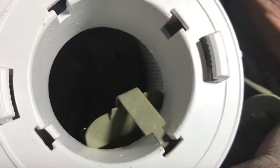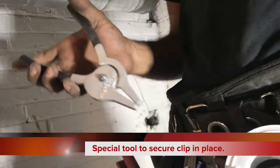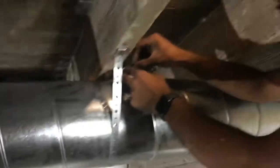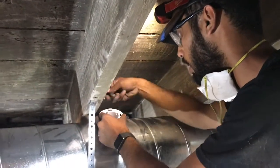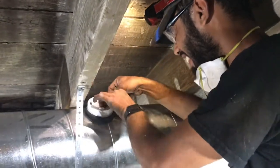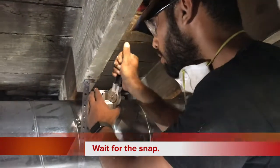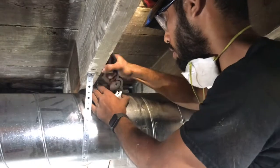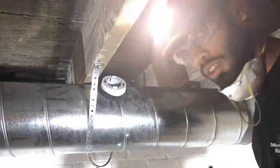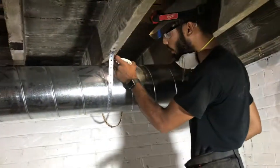There are four retaining clips that go inside. When you push them down they snap in, and space pack actually provides a tool to help with that — which comes in handy. You can do it with your fingers, but after 347 openings your fingers would fall off. You want to hear a secure snap. Then since we have this at 45 degrees, we put our coupling piece and snap that on — now it's not going anywhere, which is what we want.